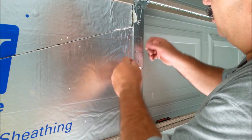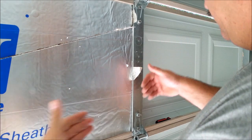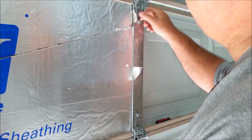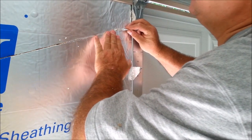You know, there's just no way to grip it and pull it out. So my insulation was squeezed down here. And I want this all to be out against these flanges as much as possible. It'll look better. So I put some aluminum tabs behind it. Aluminum tape. And that allowed me to pull it out and adjust it.